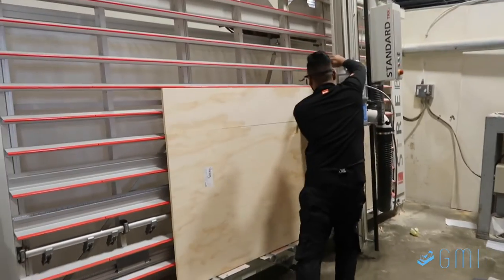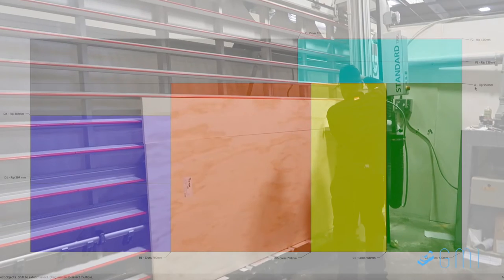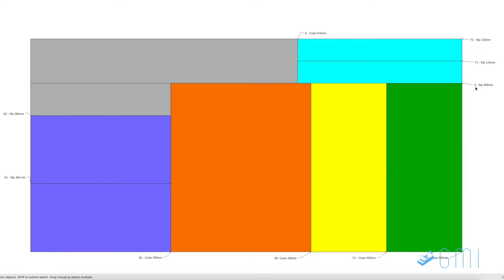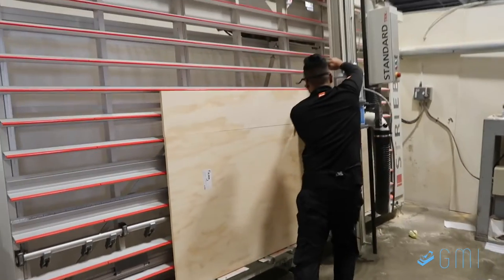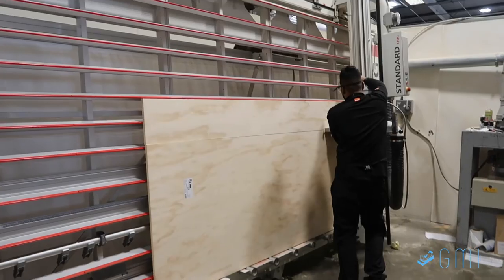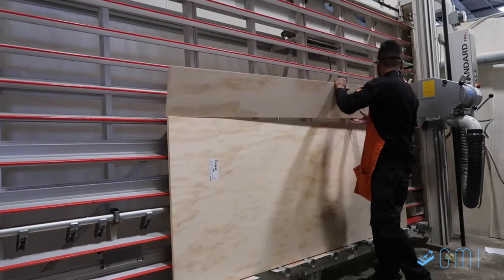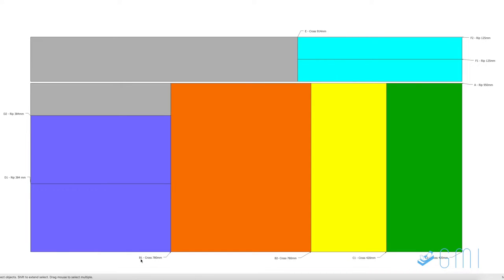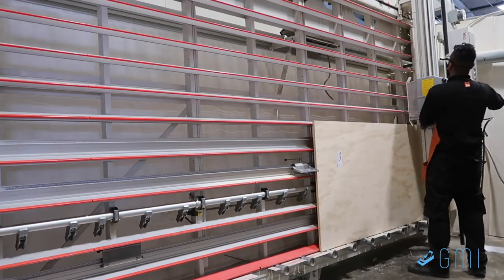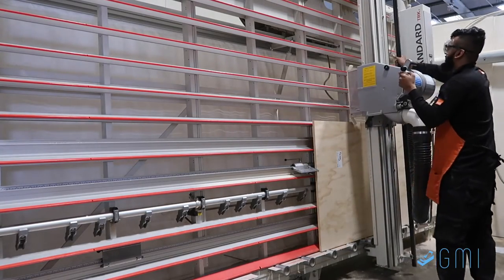Let's quickly look at the notation I used on my cutting list. The first letter simply indicates the order in which the cuts are to be made: A, B, C, D, and so on. Where it reads 'A rip 950,' it simply means the operator will need to make this cut first. It is a rip cut as it runs across the length of the board and the saw needs to be set at 950 millimeters. This is then followed by the B1 and B2 cuts, which are the same width, and it is exactly for these multiple cuts at the same dimensions that an industrial panel saw simply cannot be beaten for accuracy and speed.